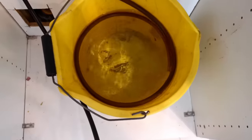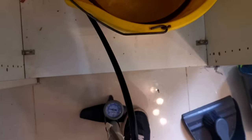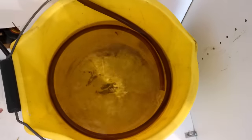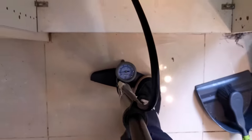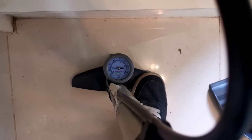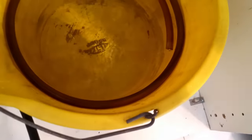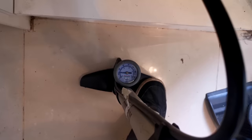That doesn't look very promising does it. But we'll see - often that'll just be a bit of air in the boiler where I've been draining it. We've stuck a bar in there. I'm going to disconnect it because my connection is leaking on the top, and I'll just keep an eye on this for bubbles and check it right at the end of the drop as well.